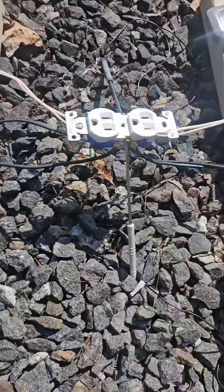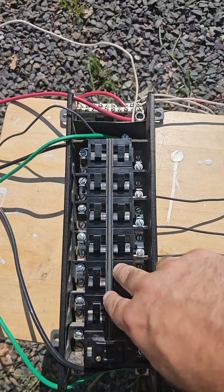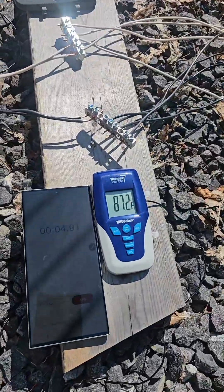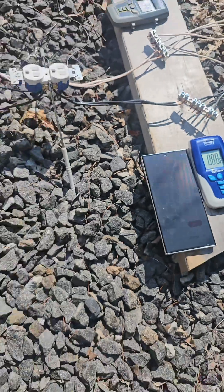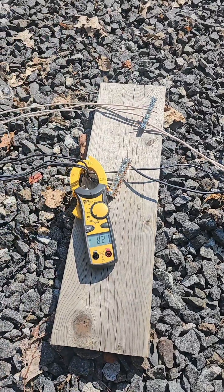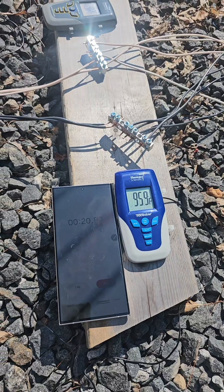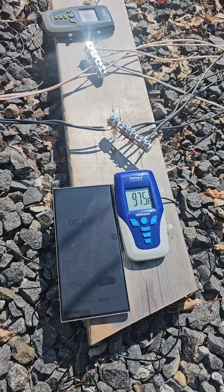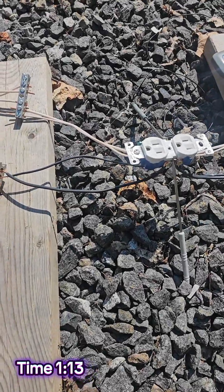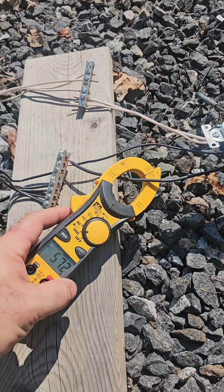Let's go melt some receptacles. Here's the before — 84 degrees, stopwatch, temperature probe on the tab. Let's turn it on. 82 amps. Oh, it's already heating up. Hopefully you guys can see the stopwatch — it's glaring on my end a little bit. And if I stutter and misspeak, it's going to have to stay because it takes a while to reset this — I've got to let everything cool back off. It is climbing pretty fast. Because I'm feeding the receptacle twice: once through a number 10 on a hook and once through a 14 on a backstab. This will tell us which path is better.